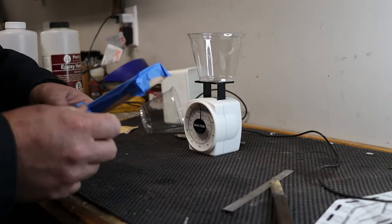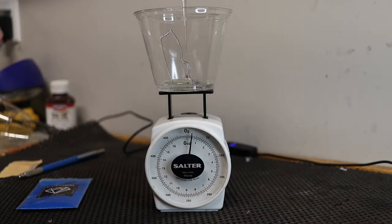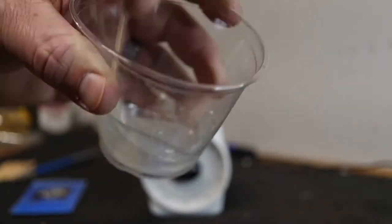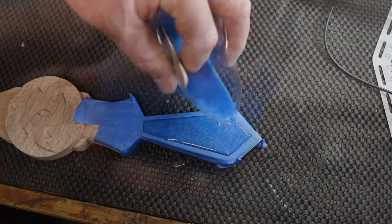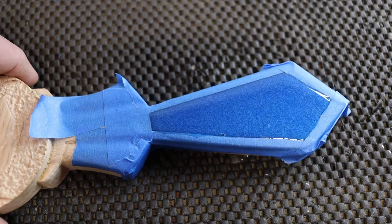Now I'm taking some blue tape and taping off the wood around the perimeter of the recess that's getting the tabletop epoxy. One thing you really need to keep in mind with AB epoxy resin is that it is paramount to mix it exactly one part to one part. I completely ruined a bar top I was making — I'd spent about a year and a half collecting beer bottle caps — because my ratio was off and it never cured. That was a lot of wasted work, so just keep that in mind.